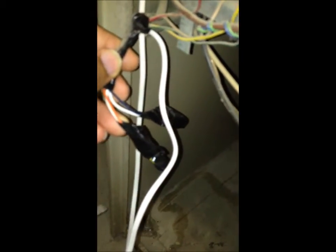This is my control board here. And I didn't have anything for a C wire or RH, nothing for power. Alright. So, again, this is what I hooked up for the power adapter. These are the 2 extra wires, the blue and the orange. As you saw, I believe the orange was hooked up to the C wire. So I went ahead and hooked this up to the power adapter.